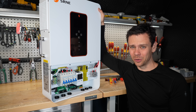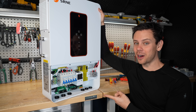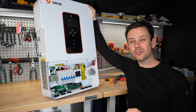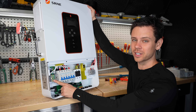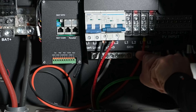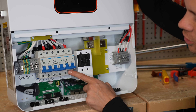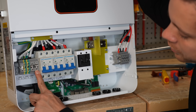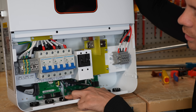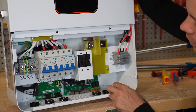The idle consumption is worse than their older models - I don't know how they pulled this off - it's 90 to 100 watts. That's the worst we've ever tested in a long time. It also needs a neutral and ground bar - I do not like these terminals. On the EG4s they have a ground and neutral bus bar in the bottom back of the case making wire management really nice. On this one you're going to have to crisscross all the wires, which makes it very messy very fast. A ground neutral bus bar in the back would fix all of these issues.